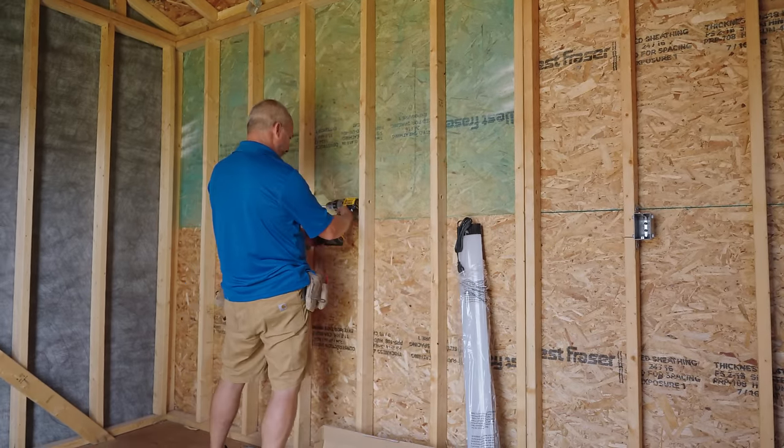Now, I know if you're an electrician watching this, you're already in the comments section. Dude, what are you using a knife for to cut your wire? I'm like, listen, I've been doing this for 35 years. You're not going to get me to buy a different tool now. When I run my knife in here, I go just to the right of the middle, okay? And I'm turning my blade, so it's running along that copper wire the entire time. It doesn't have a sheathing, it never gets caught, never causes any damage. So it's not that my technique is bad.